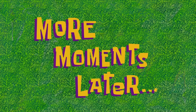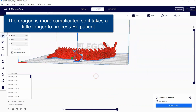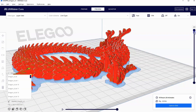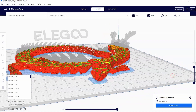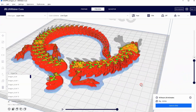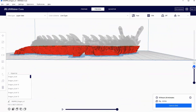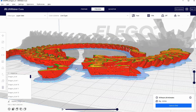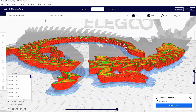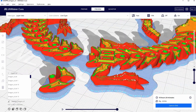Let's hit slice and go to preview. On the back end of each piece, there is just a vertical cylinder coming up, which is pretty clever. There is a little gap to allow for something to wrap around that cylinder. On the front end, you can see what wraps around is this thin little edge of a hole. It comes up at an overhang angle that is printable — a small enough angle that it overhangs just fine. Then at a certain point, it starts to bridge together, creating this entire hole to wrap around the cylinder.